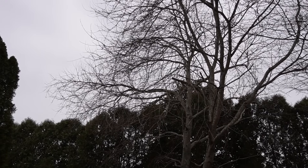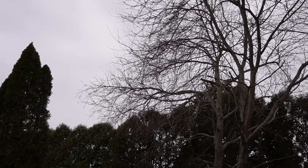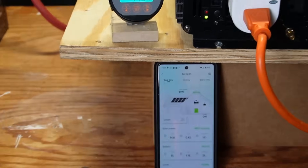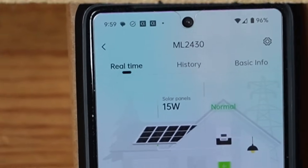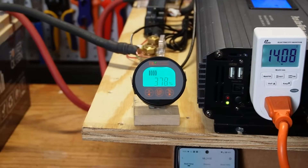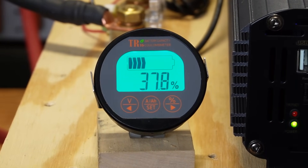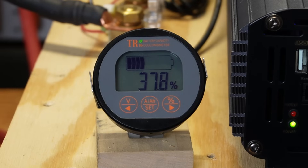It's day four, and we didn't have to wait long. It's very cloudy, and the forecast is for even thicker clouds the rest of the day. With all those heavy clouds, we're only able to muster 15 watts, which is not enough to even maintain the 24 watts we're using for the freezer right now, and we're actually draining the battery. Solar is not giving us really anything today. We're just under 38% on the battery. If things stay the same with heavy thick clouds — and that's the forecast — it looks like we will deplete the battery sometime this afternoon.